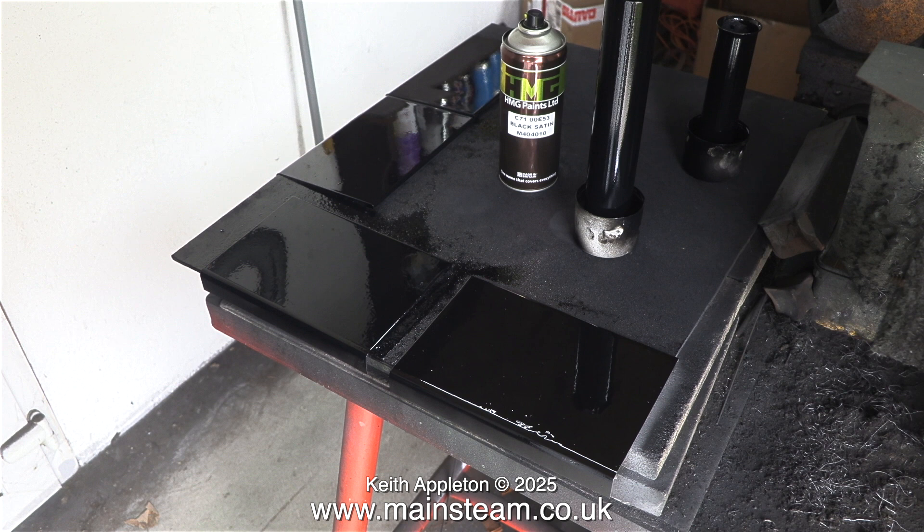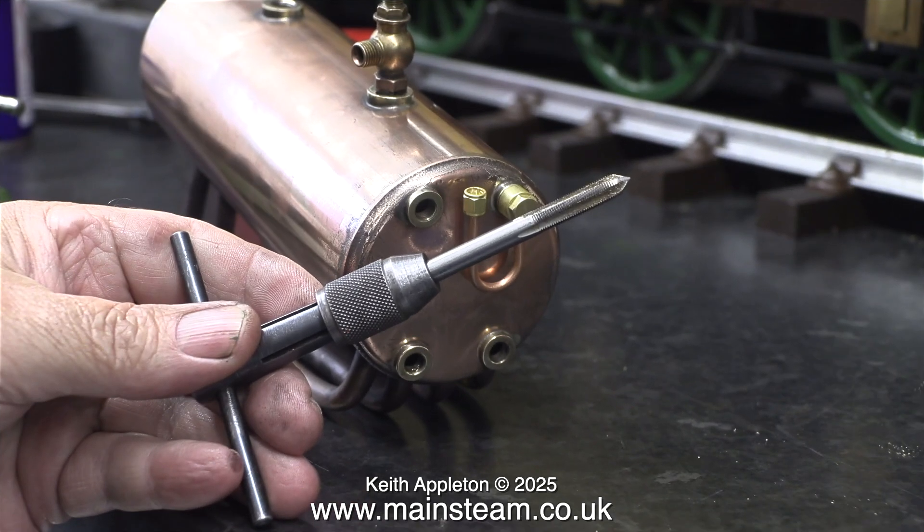Now I'm going to go down into my other workshop to work on the second 501 boiler. I re-threaded the pressure gauge siphon hole to quarter by 40. So why quarter by 40? Most threads on Stuart products are 32 or 26 threads per inch, but quarter by 40 threads per inch is the preferred size for miniature steam locomotives. I'm using it because it matches the banjo union fitting on some new pressure gauge siphons I already had, and the original 3/16 by 40 hole was damaged and corroded — hence the replacement.